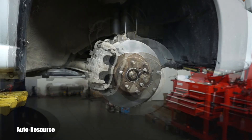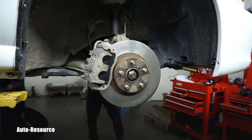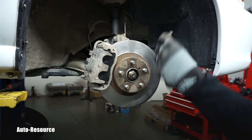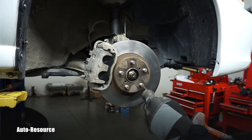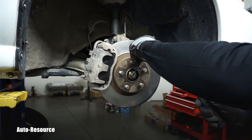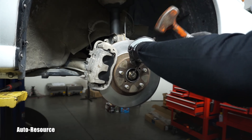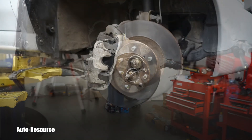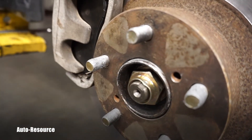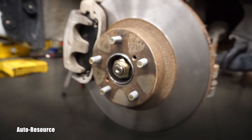The manual also says the nut should be locked in place. Use a hammer and a punch to bend this part of the nut so that if it gets loose, it cannot start rotating and fall off. I'll show you the detail — you can see the stamping right here on the top. The nut cannot turn in this situation — it's impossible. This is how it's correctly secured.